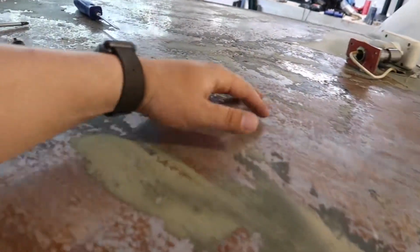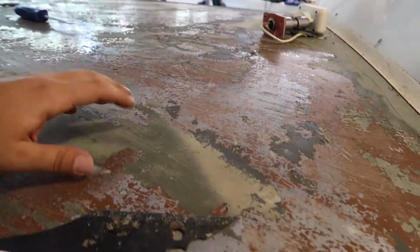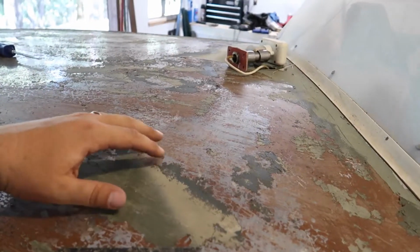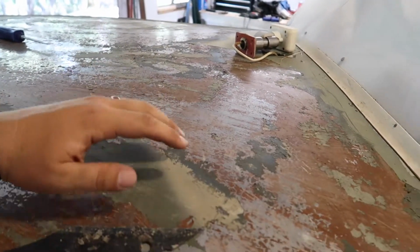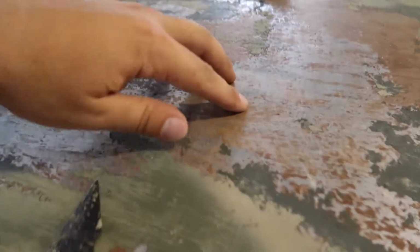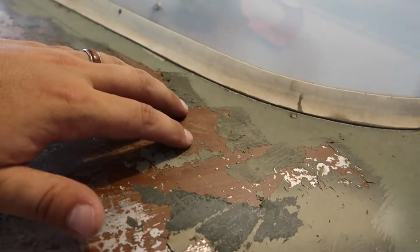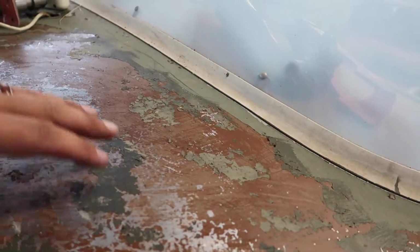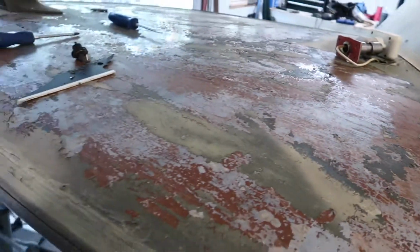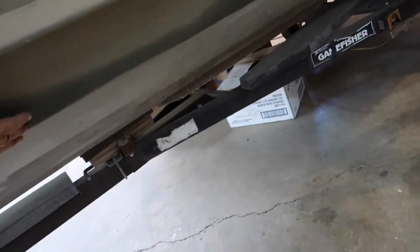Oh, and also I did a little bit more prepping on this with the chemical stripper. I think it's going to come out pretty good. So I was originally thinking about painting it, but I think I'm just gonna leave it this nice aluminum. I'm just gonna get it down to something like this, and then I have Scotch-Brite pads for my die grinder, and I'll probably do like a buffed half moon, and then cut it off and do a little design on the front, and then down this side here, and then under here I'll probably just sand smooth to aluminum.